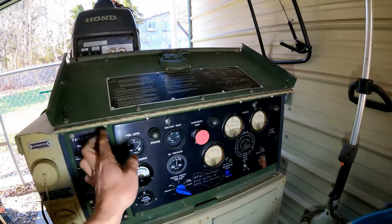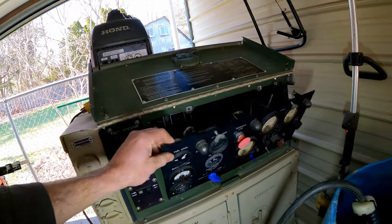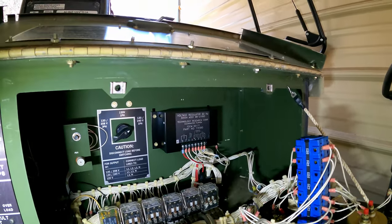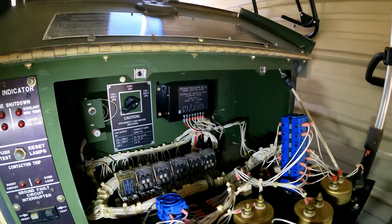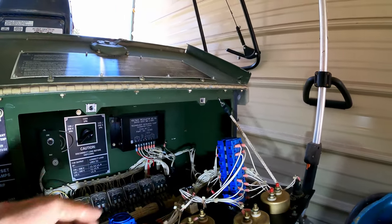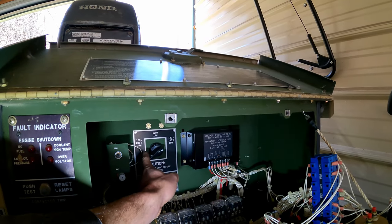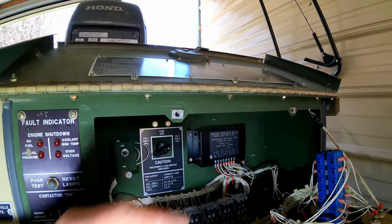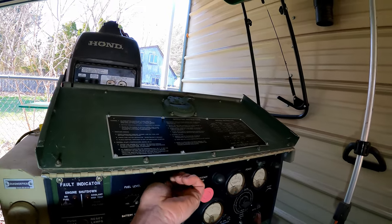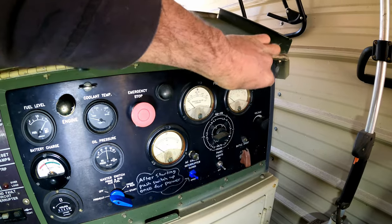Check this out — pretty cool. Pop those two latches off and here it goes. Look at all the wiring in this. One of the biggest problems with these is getting components in case of failure — like this master switch right here, very expensive. The voltage regulator, same deal. But this is where you can switch over to three phase 208, or you can go single phase 120/240. The master switch is here, and this is the phase switch — the ones that are very expensive. I was reading they go bad.